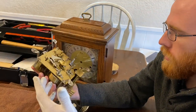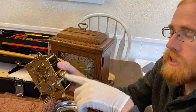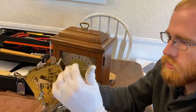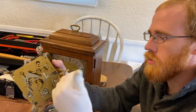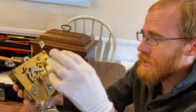So now you've got all this green goo in the gear teeth and in the springs, and that ammonia — it not only gets gooey and sticky and slows things down, it's also corrosive. Over time it actually eats away at things that you need to not be eaten away at. Short run, yeah, it'll get it running. Long run, it can actually cause damage.